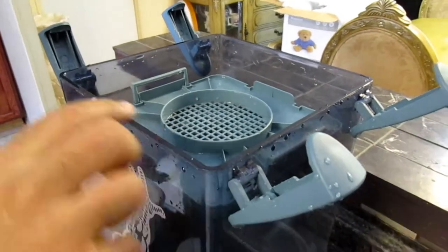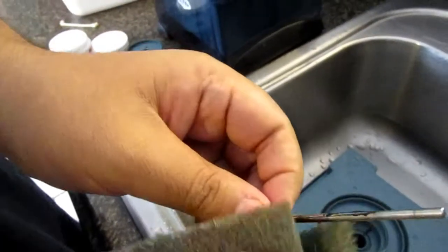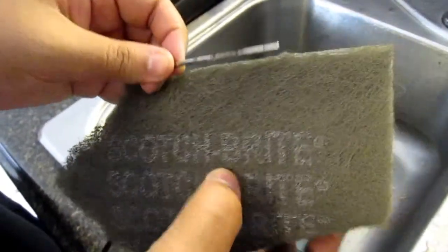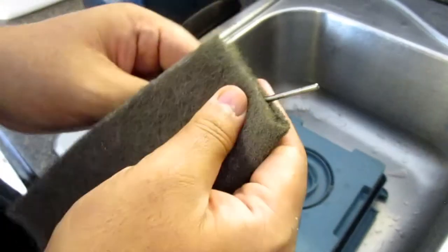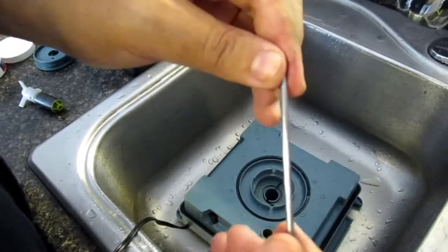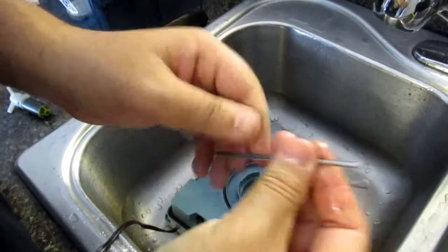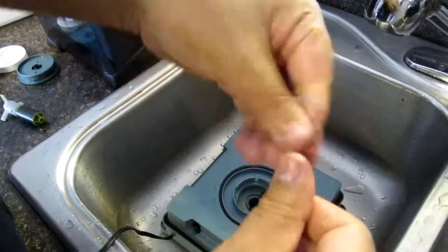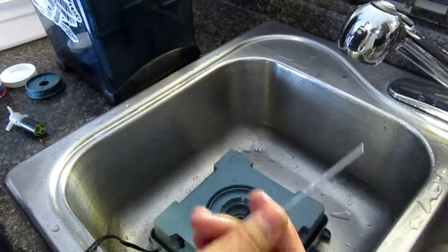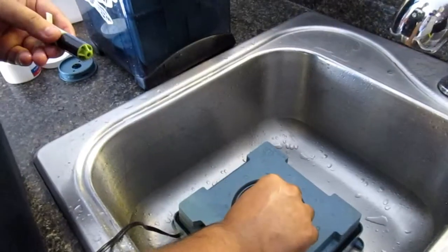Our shaft has a lot of rust buildup on it, so I'm just going to use a fine scuff pad to clean the rust off so it spins better. The shaft looks clean now, and there's no rust on it anymore. Put some silicone grease on the shaft to protect it from rusting. Keep it lubricated to reduce the wear on it. Put a little bit of grease on my magnet